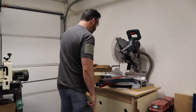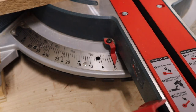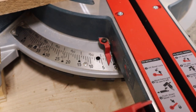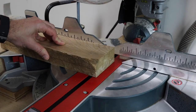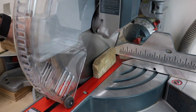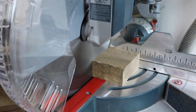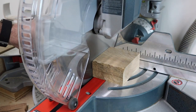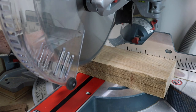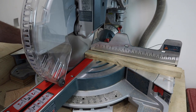With all of our pieces milled to the same thickness we're going to head over to the miter saw. Here I'm going to set the angle to two and a half degrees and make a cut on one end of the boards for our mallet head — this is going to create the wedge so that we can attach our handle. Now we set the miter saw back to zero degrees and cut our parts to three and a half inches, and we need two more pieces cut to seven inches. While we're at the miter saw we'll trim our handle down to its final length of about 14 inches.